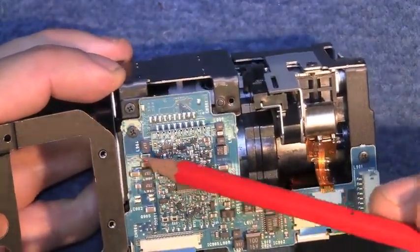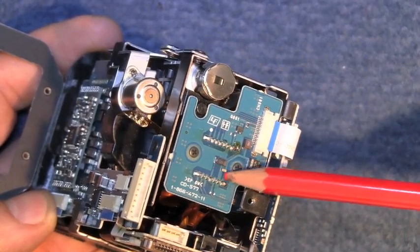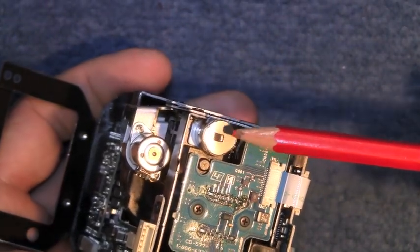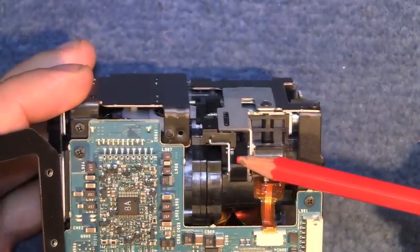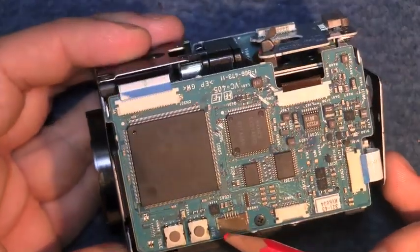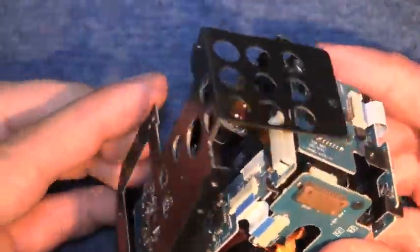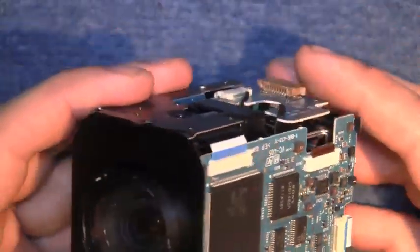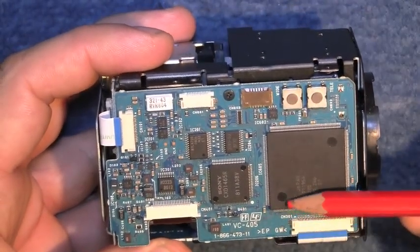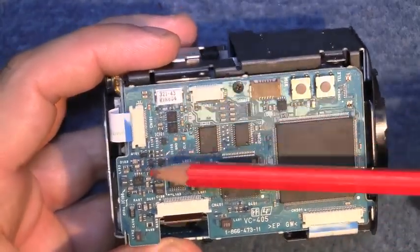The camera lens system comes all the way down to the back, and there's your image sensor on a little board. These are the motors for zoom, focus, and this will be for the iris control. There's a couple of push buttons — one for telephoto, one for wide — a bit of manual control. I still can't find out whether this is a 27x zoom or 32x zoom. The board says VC405 but nothing to give me a specific model number.